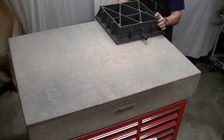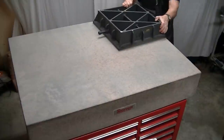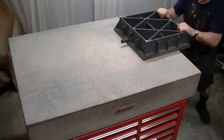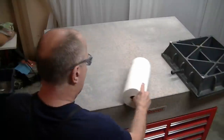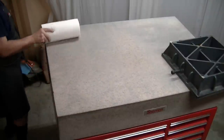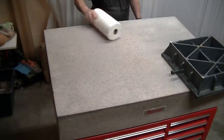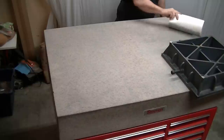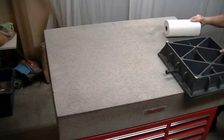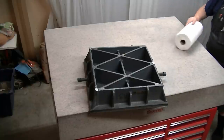So here I need to focus more, because this is important, not to let this swarf build up too much on the plates, because even with the grooves, it will tend to start to smear and carry on. So really a good thing to just keep after it. And even though I'm not roller charging the plate currently, it's got a pretty good charge on it, and this shouldn't be causing a whole lot of problem.